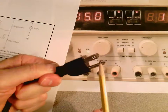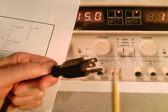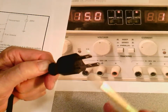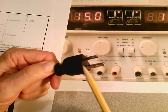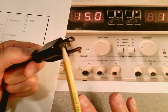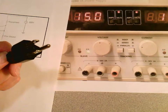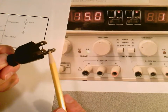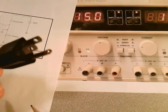So you should never under any circumstance cut off that third prong. It's a safety feature — never cut it off. Even using one of those adapters that lets the plug fit into a two-prong wall socket is a very bad idea, because then you lose that earth ground connection. One prong is neutral, one is live, and the third is earth ground — never remove it.